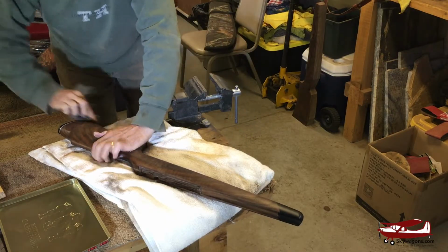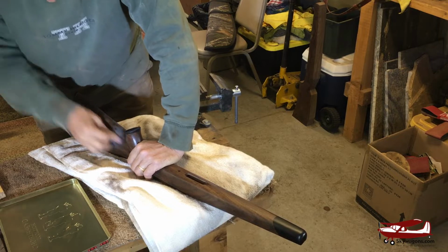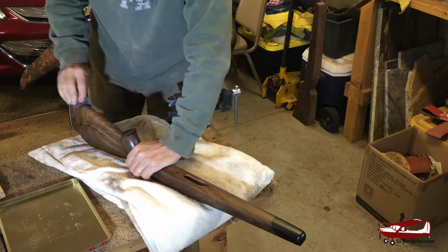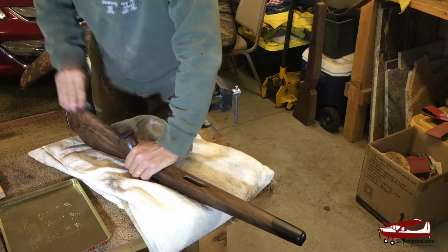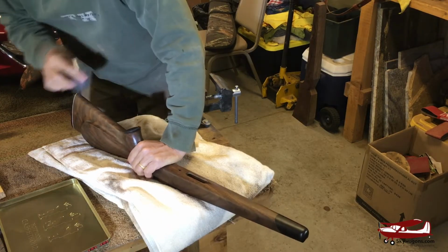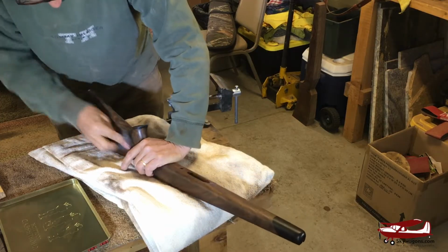And you don't have to go with the grain. Go every direction. You want to just fill it. Fill the grain. You can still see the little holes, but they're part of the appeal of it. They're part of the colour. Now they look like they're just black. I'll show it close up later. They just look like they're full.